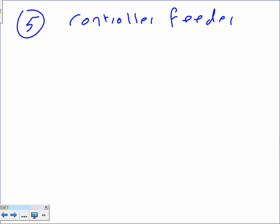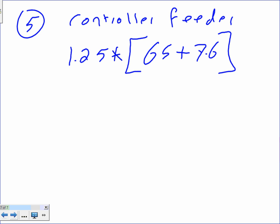If you guys look at the code for number 5, it says you're going to go to the table, and 695.6(C) is your article, and you're going to size it like a feeder that feeds 2 pumps. So what does that mean, Chad? It means you're going to take 1.25 times... this is different. 65 plus 7.6. Brad, this is the only place that I know in the code where you add them up and then you multiply them by 1.25.